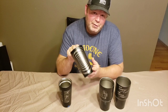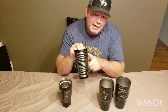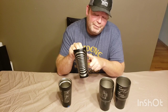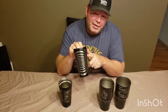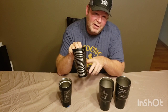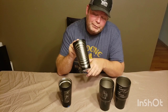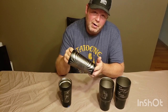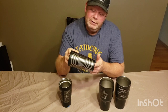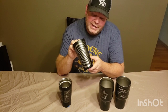But this one here, using 1,000 millimeters per minute, 85% power, had the white space scan turned on at 4,000, and a line spacing of 0.075 lines per millimeter. This cup took 6.5 hours to burn all of that image. And if you've seen my channel, for me that's like pulling teeth.